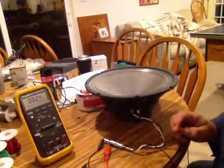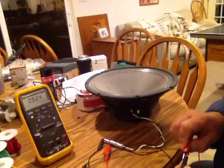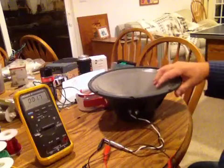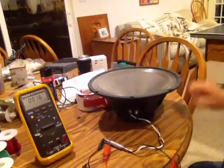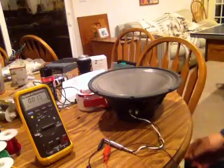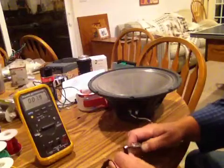I usually set it on the ground, power it up, let it run, cover it up with a Tupperware container and let that spider break in and let the surround break in — especially if it's lightly doped. So you can do that to break it in.